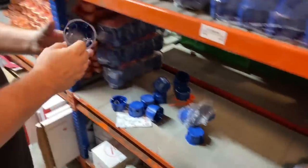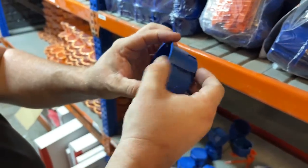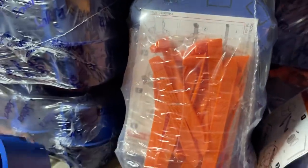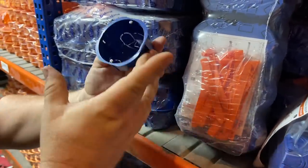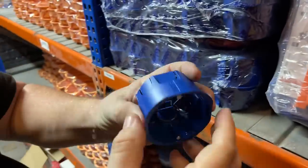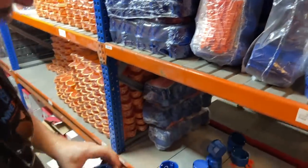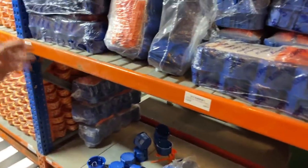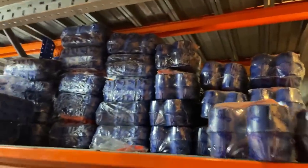Back boxes. Okay, so yeah, we've got plasterboard boxes. We have the round box, which these used to be with a little screw and two little wings. Now they come with these zip tie kind of thing. You put them in and this blocks far better than they used to. There's not a mass flange on the front of there when you cut the plastic. No, there isn't. You have to be very careful. You don't want to shake with a hole saw. Extremely careful. So there's different sizes, the blue. Yeah, so the blue is just the make. It doesn't really mean anything other than what they've chosen to distinguish their companies.